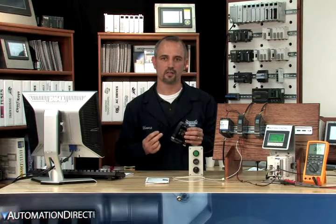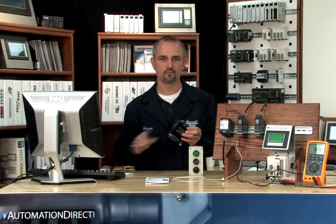Features of the signal conditioners include: they're DIN rail mountable and screw mountable. They have removable keyed terminal blocks on the top and the bottom, and these won't allow you to place the terminal blocks in the wrong place. You can remove the programmer and the conditioner will run as a standalone unit. The programmer can be left attached and you can read the values and messages — it has a three-line display. One programmer works with both signal conditioners. You can upload and download programs with the 105 programmer, but the programs must match the signal conditioner type.